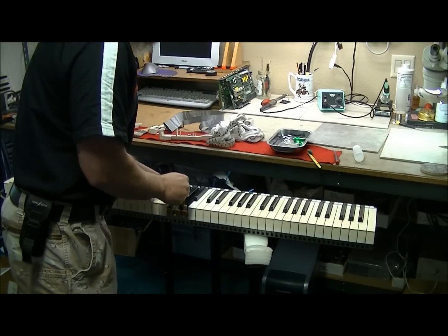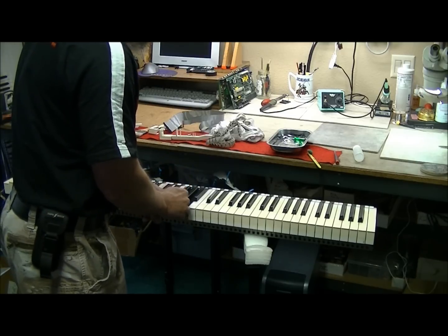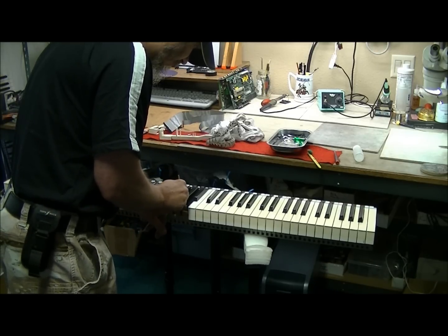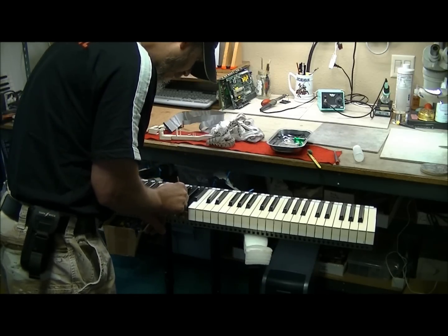So the tail end of the weight, there's red felt on the tail end of each counterweight. And that, the key pressing on that counterweight and rubbing on it, is what's causing that squeaking noise. So first thing you want to do is clean the felt. You can use your chopstick just to scrape, rough up the top, clean the counterweight.